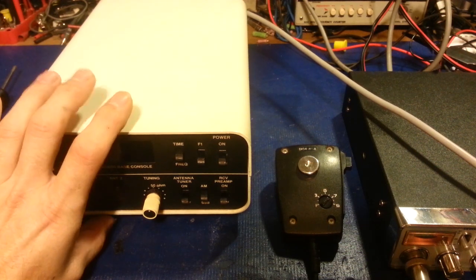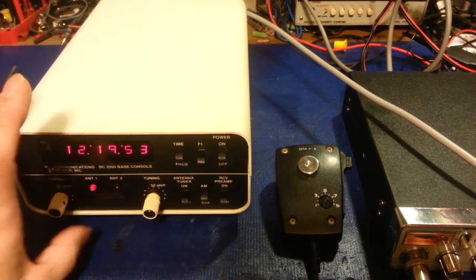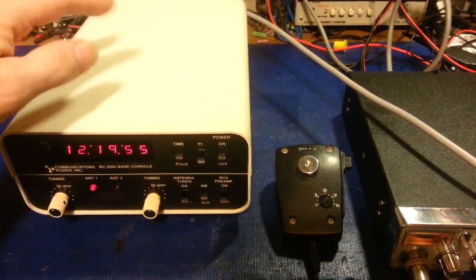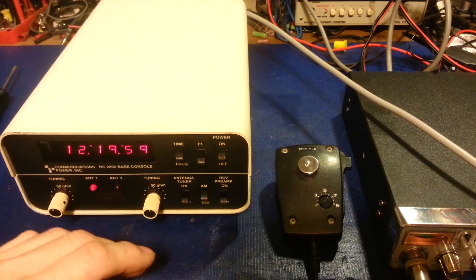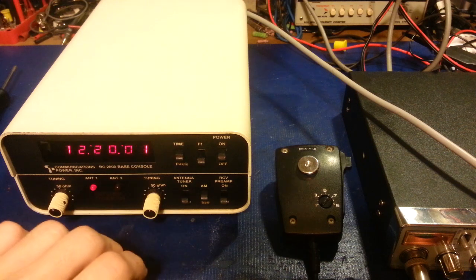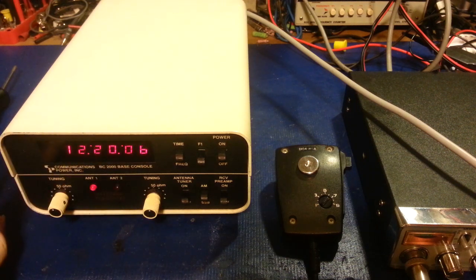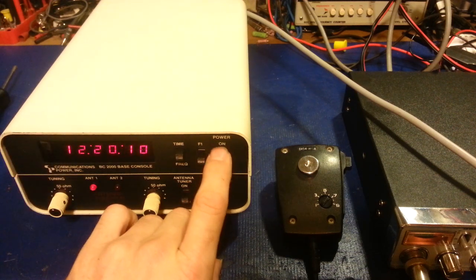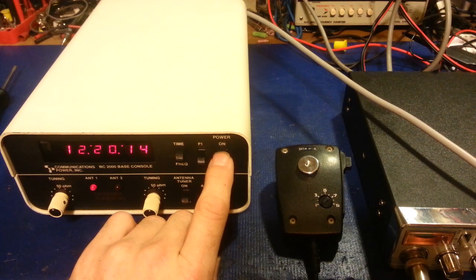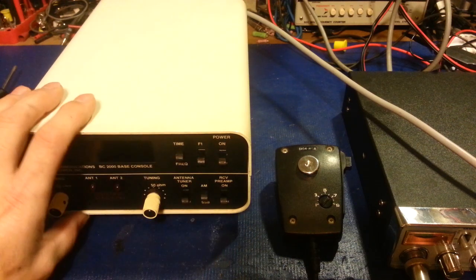It's not going to be up to 100% full operating temperature, because once you actually turn it on, there's a little bit more load on the system. A lot of other circuits become activated in here. It'll increase in temperature a little bit, but the change in frequency will be very small compared to the standalone frequency counter that didn't have a clock, because when it's turned off, the actual 120-volt power line is attached to the power switch. So when you turn the FC70 off, it is completely off. There's nothing still on inside.